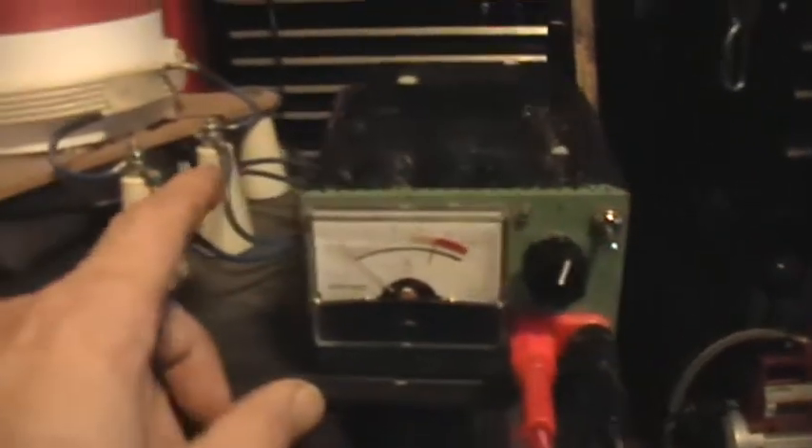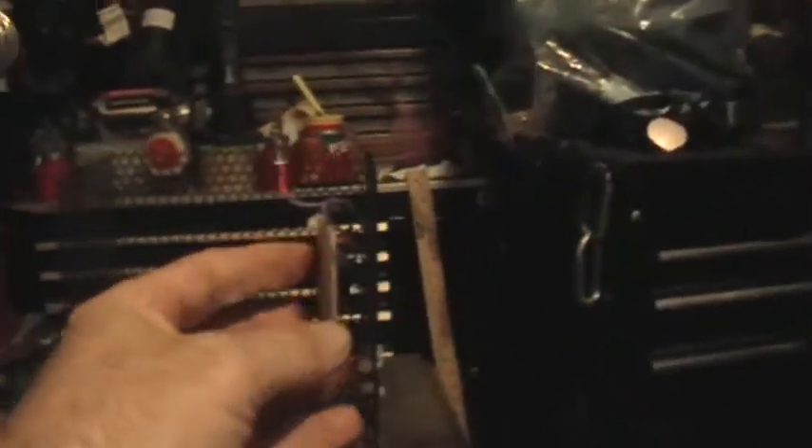There's where the DC power input comes in. This is the bias control, which controls the voltage that the MOSFET sees coming from the sense coil. This is a little bit of circuitry using an op amp and an LED that monitors the temperature of the heat sink through a little thermistor that I have glued to the heat sink right there.